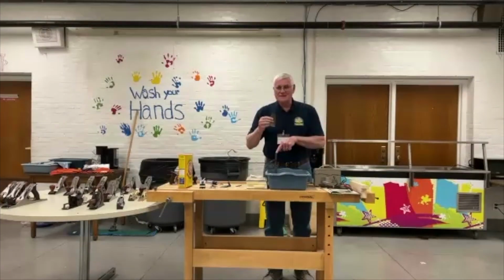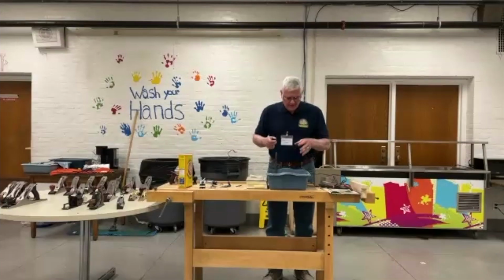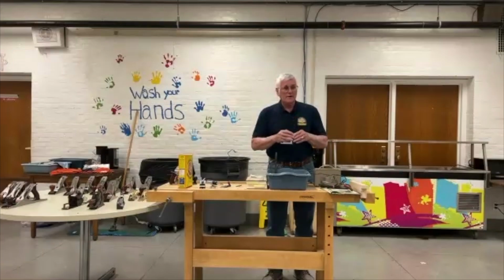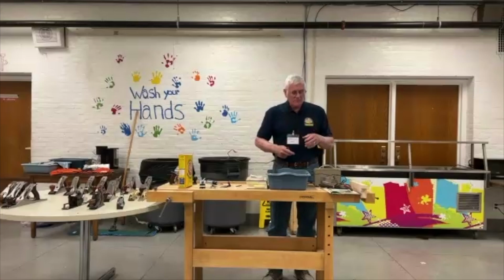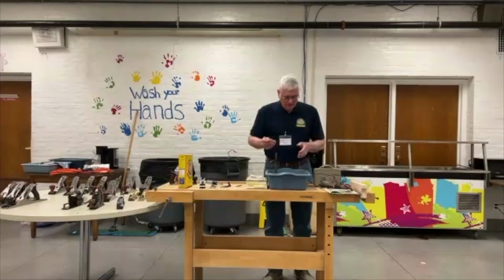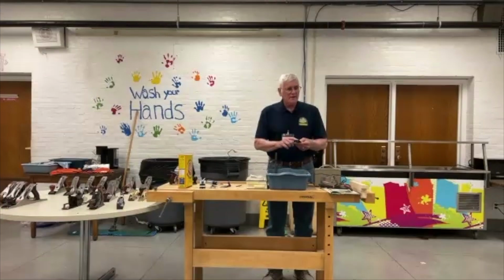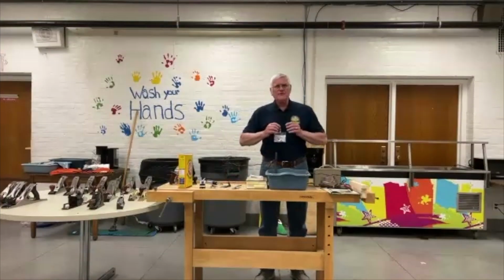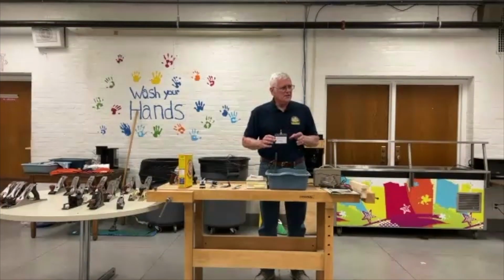You'll actually see it. After maybe 4 hours, you'll see this gray stuff and green and brown bubbles on the water. And that's the reaction that the electricity is causing as it flows through the water. And it's pulling the rust with it. And it produces a little bit of hydrogen. And that's not a bad thing. It won't hurt you. We already have that in nature anyway. But it's clearing all the rust that's on here. And it works extremely well. After 2 days, I've never found a piece yet that had any rust left on it. It literally takes it all out.